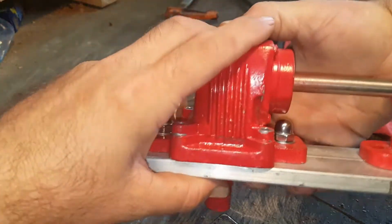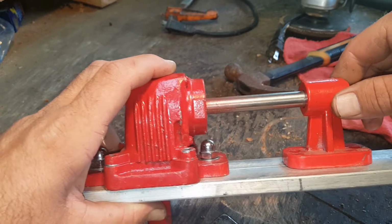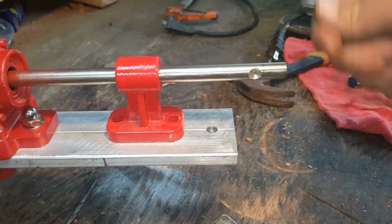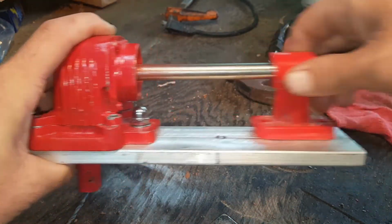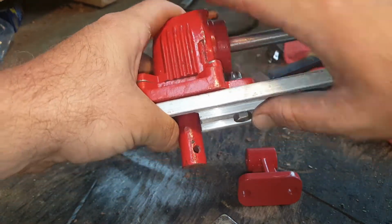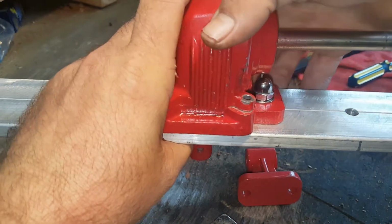Okay, I'm gonna try to do this justice. This kind of looks orange through this camera because I got a light shining on it, but it's red. And anyway, your crank handle goes out here, and this sits on top of your barrel like this. What you got to do is take these 2 screws out, slide that off. Then you got your little gearbox right here, this of course goes down into your spinner, to your extractor.